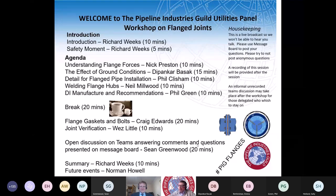Now we're starting to get a theme of the main materials in water pipes: ductile iron, steel and the plastics, predominantly polyethylene. So the next presentation by Neil Millward is one of two presentations, one on steel and then the second one by Phil Green on ductile iron, to give you an introduction as to how flanges or flanged pipes are made. And it's interesting that whilst they probably look very similar when they arrive on site, when they're all painted and welded, the techniques used for attaching flanges to pipes are very different.